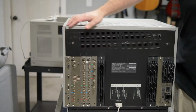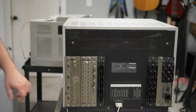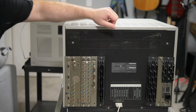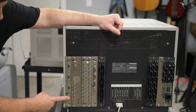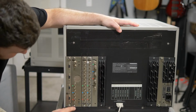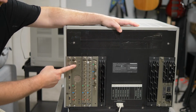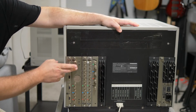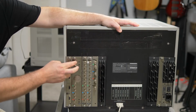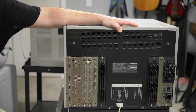To go through the ones that are here, we have the ISR control board, which is going to be in every BVM. Everything has one of these to help with control as well as programming what's inside. Over here is the 41HD, which has HD SDI, which could also do SDI. It could not do 480p, believe it or not, but it can do 480i, 720p and 1080i.